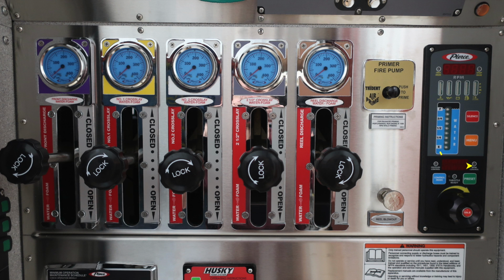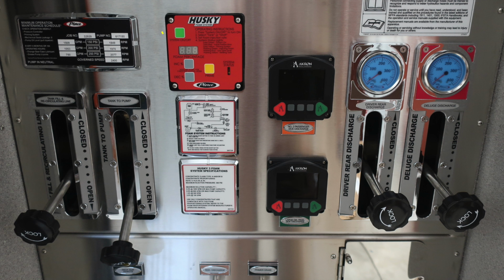Moving down once again to the blue button, this is the control mode, which allows you to gain either pressure or throttle. Located in the center, you'll find a throttle ready indicator. To the right, you can work through the manufacturer's recommendations on the presets for pre-programming certain pressures. Down in the lower section, you'll find your throttle increase or decrease with an idle button.